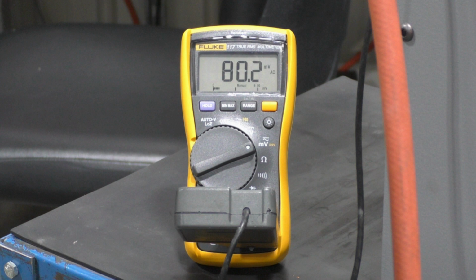If it is sealed properly, any pressure loss should be less than 0.3 pounds per square inch over a 15-minute period. Note that if the heater blanket is on, it may take considerably longer for the pressure to settle after turning the heater blanket off. If the pressure drops more than 0.3 pounds per square inch over that 15 minutes, the powder feeder's seal is compromised. In this situation, perform the following steps.